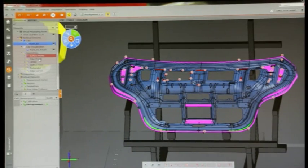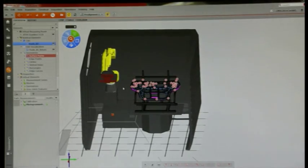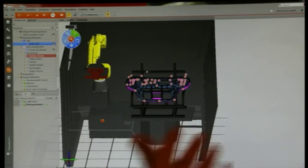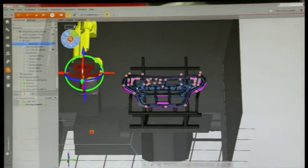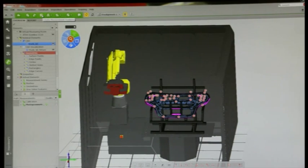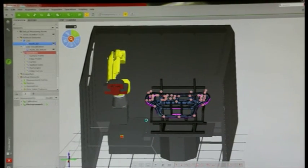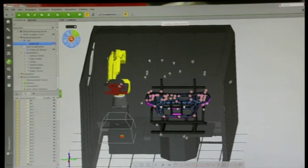The new V8 software — this software is called ATOS Professional, manufactured by GOM in Germany. The new function that I believe no other software does is we have the ability to auto program features that we want to inspect on our part. Instead of manually creating robot positions, I can now generate automatically all the positions just by clicking on create measurement positions. It's going to find every one of those features highlighted in the Explorer and create the positions it needs to measure that feature. Because we use volume-based scanning, the surface will come with it.